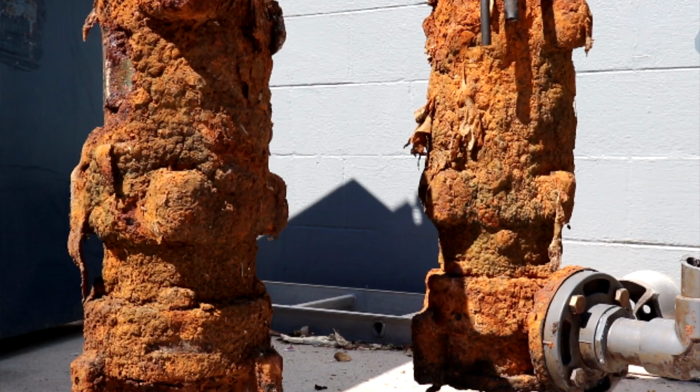Therefore, the pump was getting hot. It was just drawing, pulling all that heat, and basically all the material was getting stuck to the pump because it was hot. I started doing more inspection, went deeper into it, and found out that the pumps were internally damaged. So that's why it was drawing so much amperage, and that's why it was blowing fuses left and right.